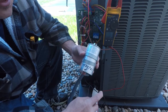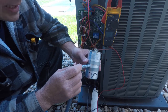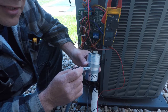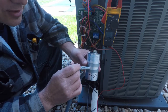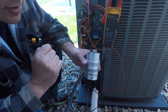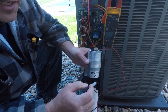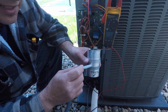Typically, if it's out of range, it's going to keep your fan or your compressor from running. You can find these on Amazon or any online supply house. Contractors are going to charge you anywhere from $150 to $400 to change one out — and when I was a contractor, I would buy these by the 50s because they were so common to go out. If your heat pump or air conditioner stops working, and you see the capacitor mushroomed up and rusty, chances are this is it. This is the number one thing I check first, and the second thing would be a contactor.